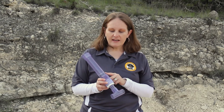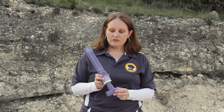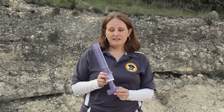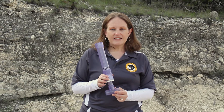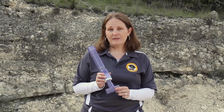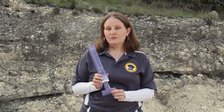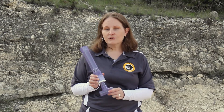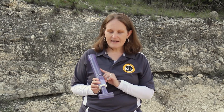This one uses clear pipe and a piston that was created using a 3D printer and it has gaskets. When a valve is closed quickly, the force will come back into the water hammer arrestor and compress the air, taking all the force instead of going back through the pipes and shaking them. This is a homemade water arrestor and it can't be used at full water pressure in a house. Store-bought water hammer arrestors are usually metal and you can't see inside them, so this was created for educational purposes and can't be installed in a home.